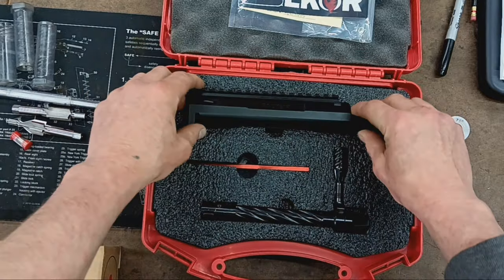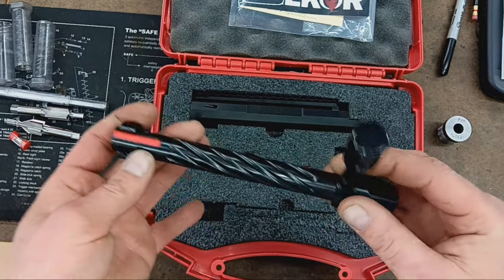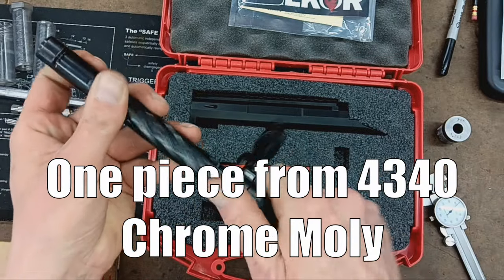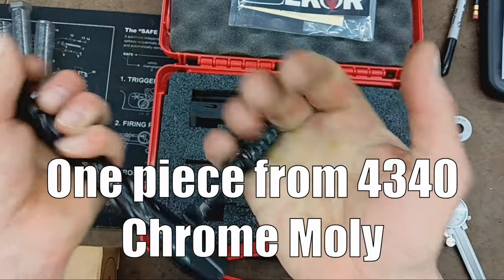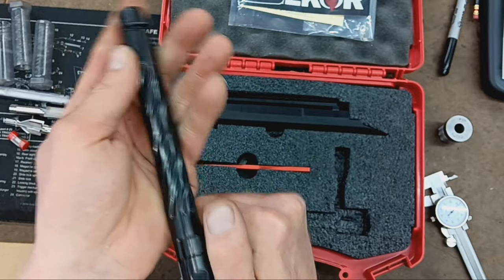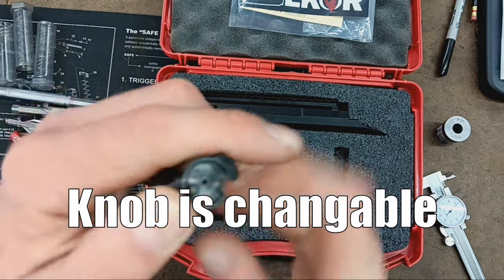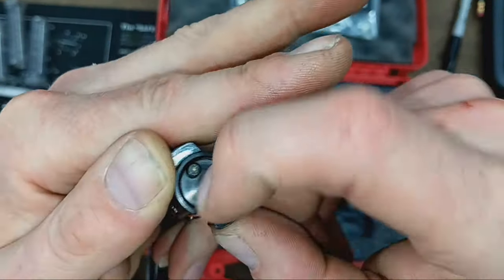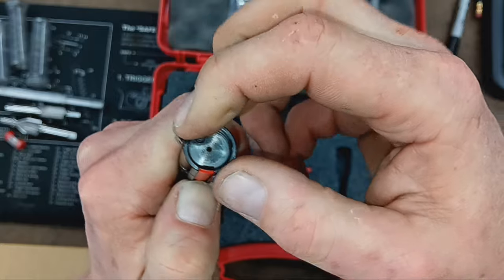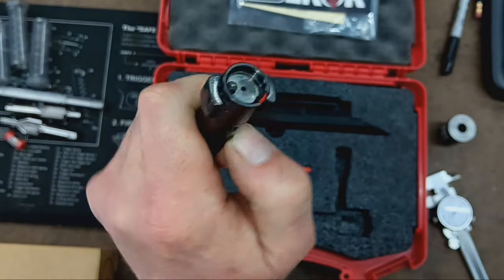Okay, so I think that's enough for that receiver portion of the review. On to the bolt. Very, very nice bolt. Again, very well machined, impressive. Nothing sharp, but yet it provides grip with the fluting that you see. Very nice beefy bolt knob. A cleverly colored extractor claw, an M16 style extractor that has minimal pivoting. So you'll basically cut your bolt nose recess to the standard 705 size and have no issues with it working there.